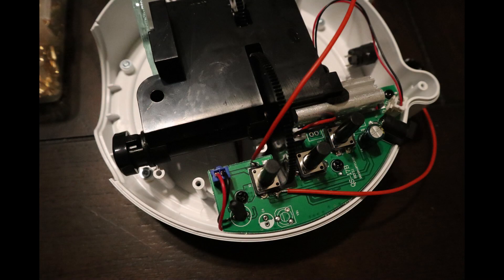Here's the most important thing: the top left corner and the bottom right corner are where I decided to solder my connections in. If you take a wire and touch those two pins together, they will act as if you pressed the button, and it will keep the unit on when it powers on.